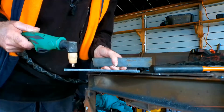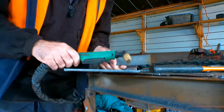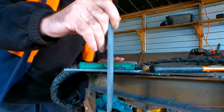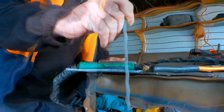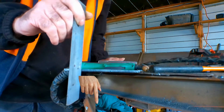I'll show you what I mean. First of all I'm just going to do a straight cut along here — this is about a five mil plate. What you'll notice is I'll be doing it at the right speed for the plasma cutter and torch, so the sparks should be going straight up and down. If you've got the right speed, the right distance, the right air pressure, your sparks should be going straight down like this, or very close to straight down.